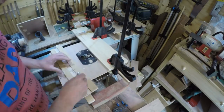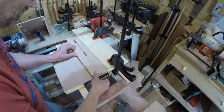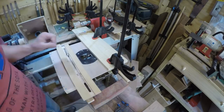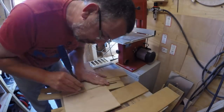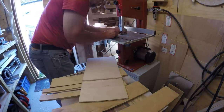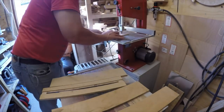Then I'll move on to a smaller bit — and don't do what I did here, don't go backwards on the bit. It should turn over and go to the other end as the wood will kick back. Once the glue had dried, just clearing off any odd bit of glue with the chisel so it will slide nicely on the saw. Then cutting a stopper block on the end for how far I want the board to slide onto the saw.